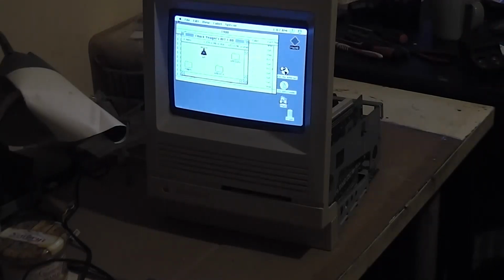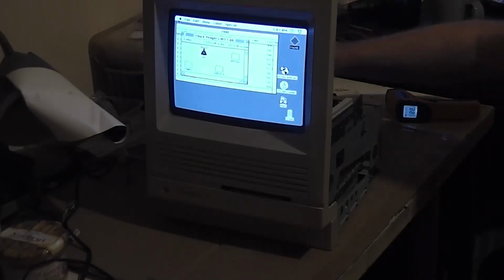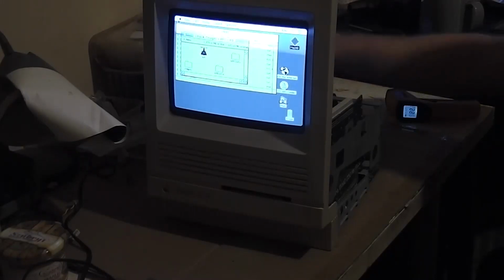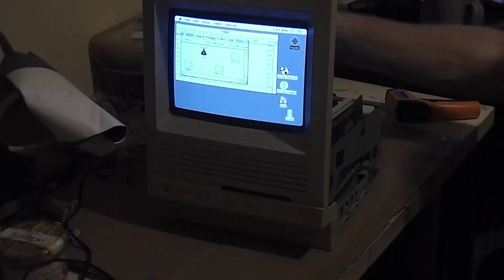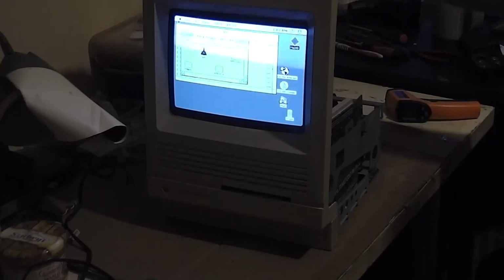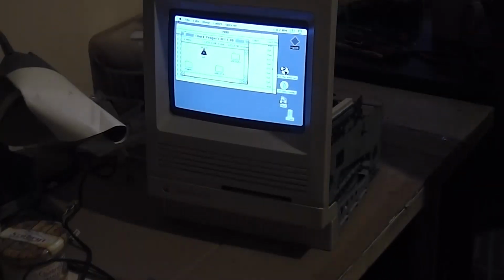So yeah, it's looking pretty good. There's no heat in any of these wires. And this little fan that I put in for you is really pushing some air. Without the case on, it's not really effective, I suppose. But without the case on, it doesn't have to be, because whatever heat is there is coming straight up. I feel a bit of heat coming off the flyback. 24 degrees. That's all I'm getting. No extreme temperatures.